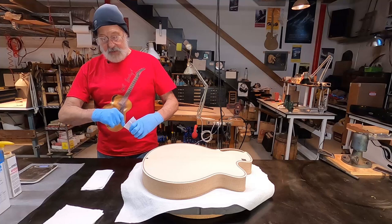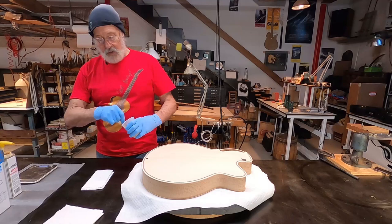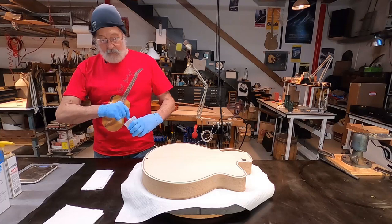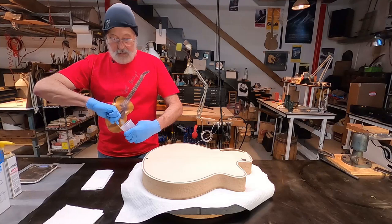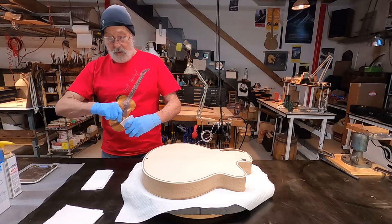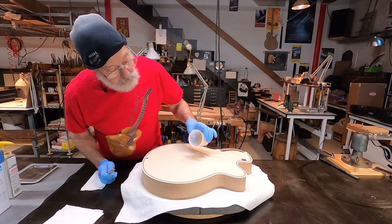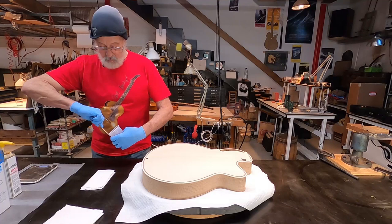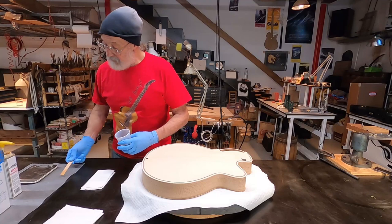So, this epoxy is going to do several things for us. One is, as you'll see in a moment, it has the correct index of refraction to be a good complement to wood. And so it looks beautiful as soon as you put it on. It makes the wood look fantastic. You can see that it's not quite clear. There's a little bit of an amber tone to it. That comes from the hardener component. It doesn't add a lot of color, but there's a little color and it's in the right direction.